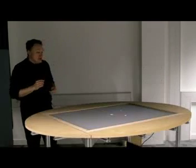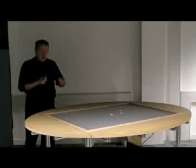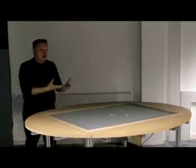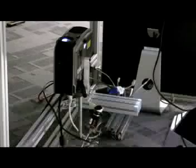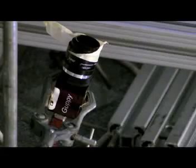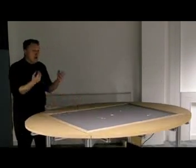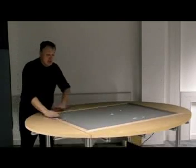However, what makes it interesting is if I put my finger on it here, the finger interrupts that process and suddenly the light escapes — and what it looks like is that my finger starts to glow in infrared light. Under here we have a projector, and along with it we have an infrared camera with a natural light filter. So it filters out all the light from the projector and all it can see is the infrared light being emitted by my fingers.